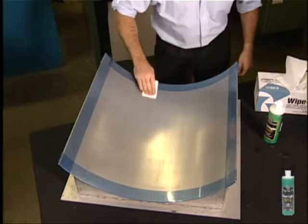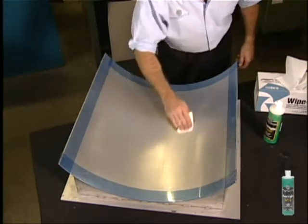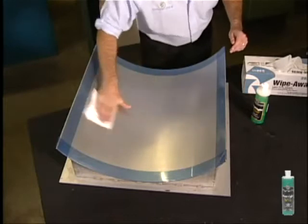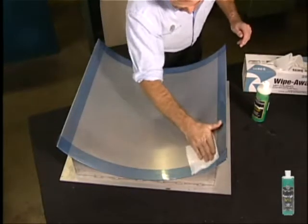Since you will be wiping this coat off right away, you don't have to be so careful about applying too much. It is normal for the conditioner to bead up on these subsequent applications. Immediately, wipe this coat off. You don't need to scrub, you're just removing the excess material before curing. Now wait 15 minutes.